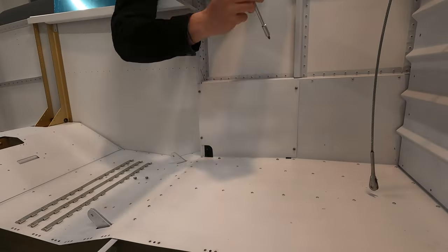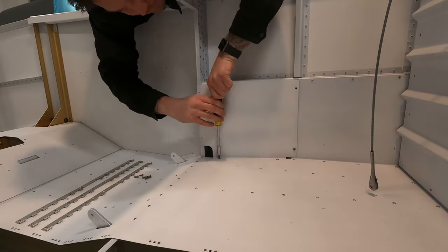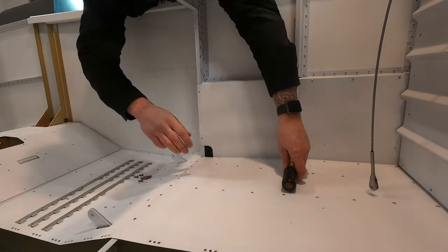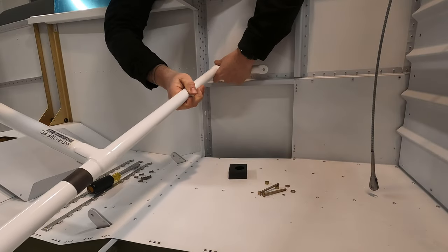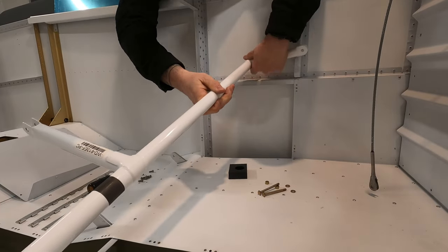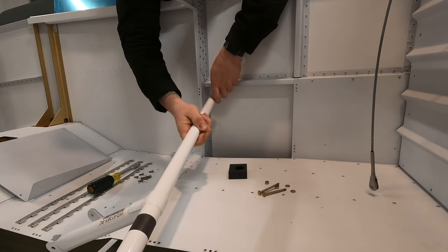So I thought I was being all smart and figured I'd have to fit the weldment before I fit the second bracket, but I should be able to sneak it in. I won't have to do this twice. Nope, turns out I gotta do it twice. It's such a tight fit in here that I actually have to sneak it in with both the bearing blocks, because I can't get an angle at it to slide it into one bearing block ahead of time.